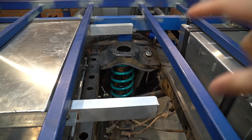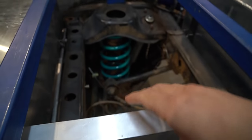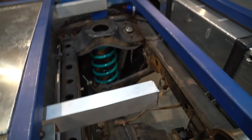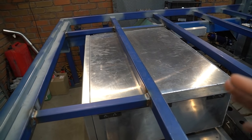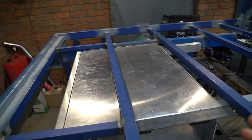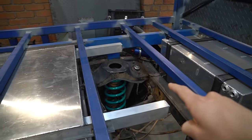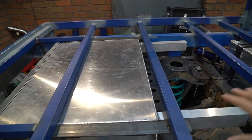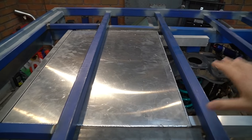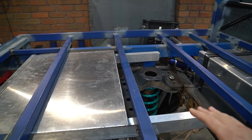I guess ideally what I'm looking for here is a water tank, maybe 50 to 70 liters. So there's definitely enough space between these cowlings so I can actually get a water tank in there. This drawer, the sliders are rated to 100 kilos. The drawer itself probably weighs around 20 kilos. So let's just say we fill the drawer up, we're at 120 kilos there. Say we're at 50 to 70 kilos for the water tank. Round up, we're around 200 kilos. So 200 kilos really close to the chassis. The weight's nice and low down, which is supreme for handling.